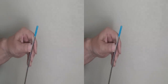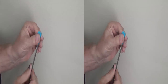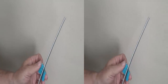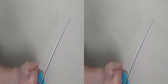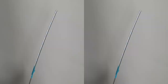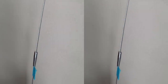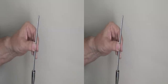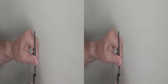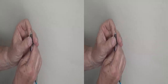I'll do a quick close-up of putting one of the fittings on. After cutting, you have tape on both sides — hopefully you take that tape off. Then I take a piece of tape and put it around the wire end. I slide the sleeve from the fitting over it, which holds it right there so it doesn't fall down — if you're working with a real long piece it gets frustrating if the sleeve falls two feet away. Then I peel back the outer wires, holding my hand up tight.